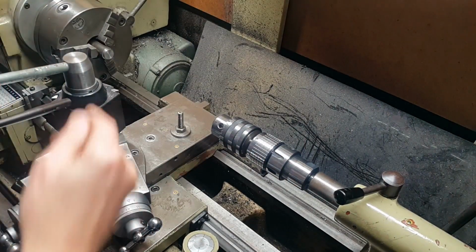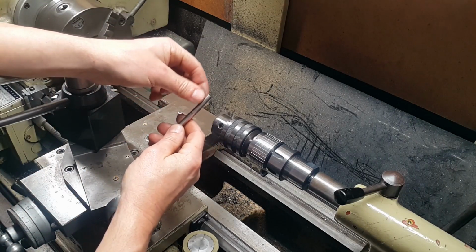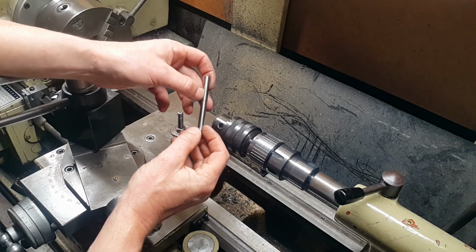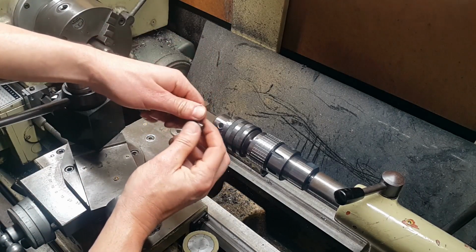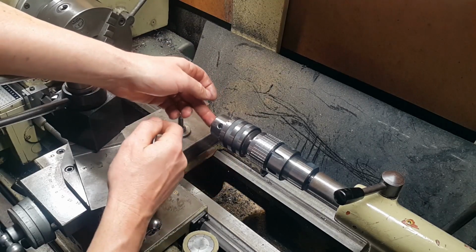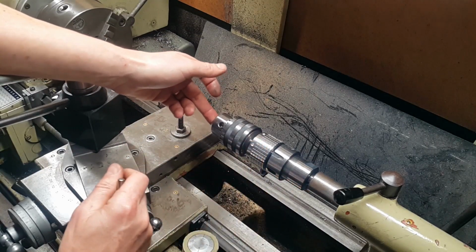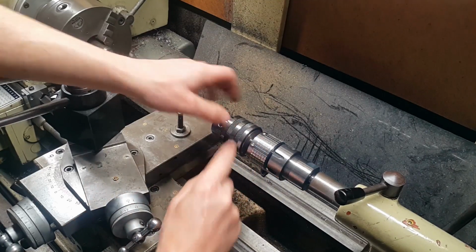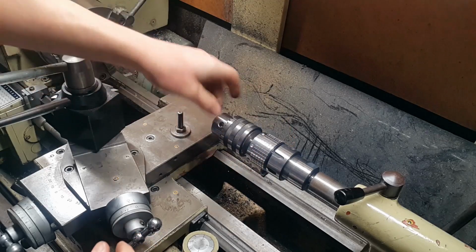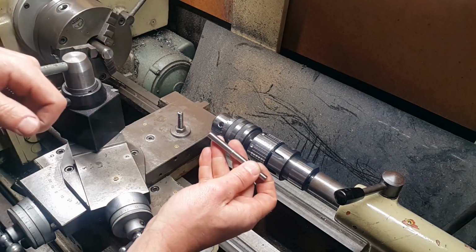what I'm going to do is drill out to an 8mm hole. So we'll go slightly under 8mm obviously, and then we'll ream the hole out to 8. This is a piece of shaft out of a CNC machine, so it's dimensionally accurate. It's spot on 8mm. So it'll be interesting to see how this is going to work, and to what effect it gives us an accurate hole. So anyway, we can use this for drilling as well. If we do the nut up, that will centralise this straight into the middle, and then we can drill that hole into the piece of steel, and then we'll ream it out, and then we'll give this a try.